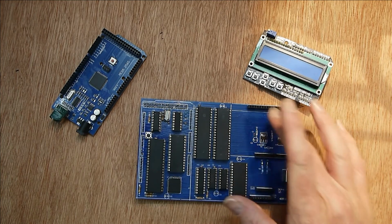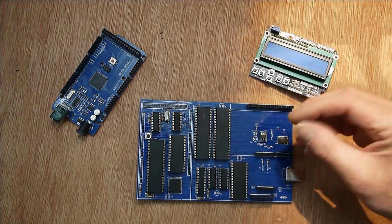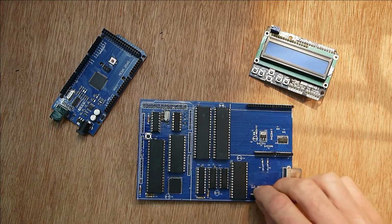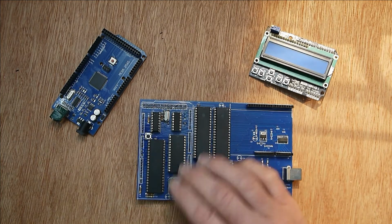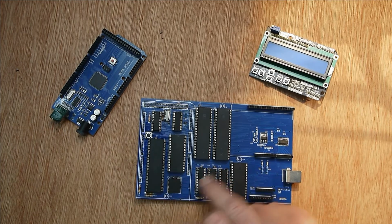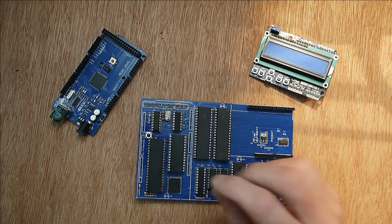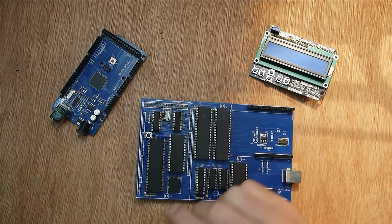That's not wired into the Arduino shield because there's no switches. You don't switch the line to be a PWM line or a GPIO in hardware. Here you have to wire the PWM here, so you could control servos down here. The RAM, there's 32k of RAM, which again is quite a lot. That's more than a lot of the Arduinos have. So there's masses of flash, and that's bank switched, so there's some hardware here that lets you switch in different pages, so you can have 512k of code in this thing. You'll need a little bit of code that lets you switch between the pages, which is in every page, and you lose a little bit, but that's only a few bytes.